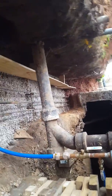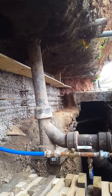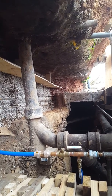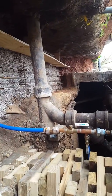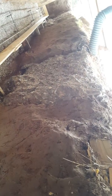So the minimum that's required for the area that I'm in for laying 8-inch cinder block is a 16-inch wide, 6-inch deep piece of footer. Okay, what I'm going with is I have at least 16, in some places 18 to 20, depending on how far I dug back on the bank. It's just the necessity of it, and I'm going 8 inches thick. That's what this form is, it's a piece of 8-inch plywood that we reinforced all along. I put stakes in it, and then we reinforced it against the bank.